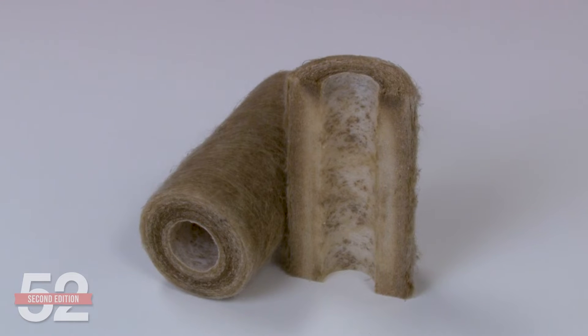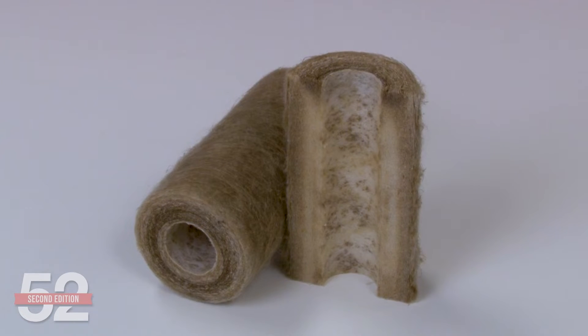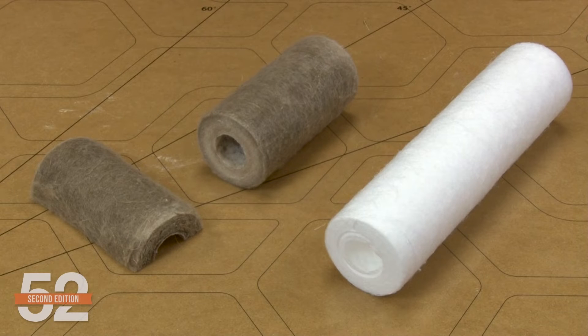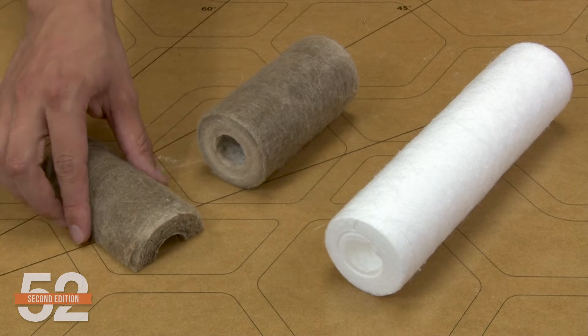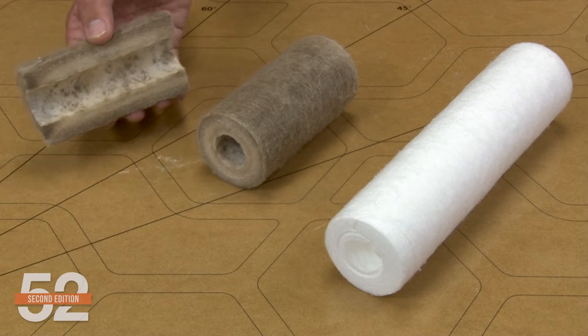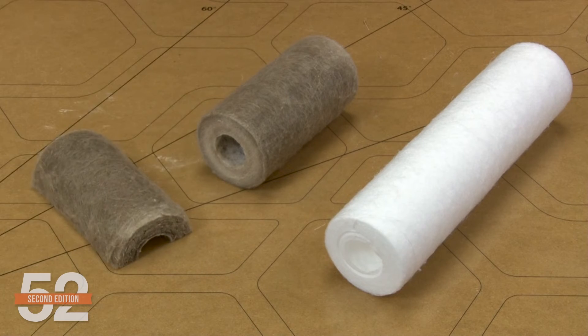A couple of ways to know when to change your sediment filter. Sediment filters will often get visually dirty, which can be a sign that they're depleted, but just as often they'll last a lot longer than that. They capture dirt, so they often look dirty on the outside. However, a good depth filter will capture sediment of various particle sizes throughout its entire thickness, so visual assessment is really not the best way to judge the state of the filter.